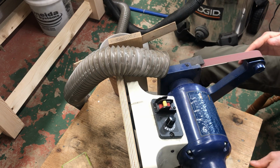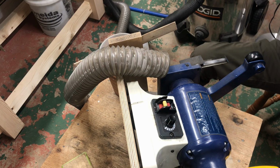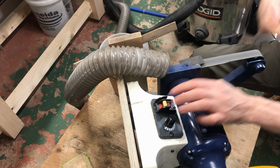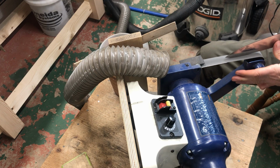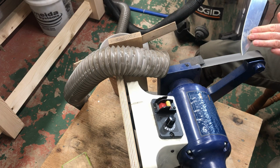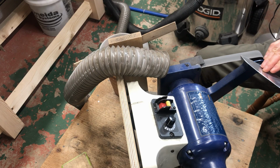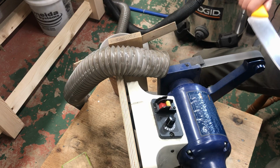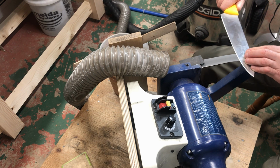And now we are going to replace a belt with a Trizact A30, which is approximately a 600 grit belt. I will again refine the scratch pattern on the primary bevel, but I'll also polish the secondary bevel that I've created and round over the spine nicely. The reason I smooth out the secondary bevel is so that you don't feel the roughness of the 120 grit when you're cutting, and you do feel it. So it's better for the food, it doesn't tear it, and it's better aesthetically as well.